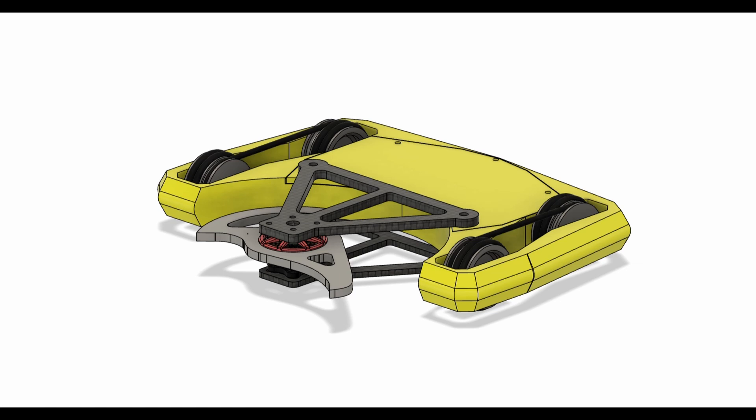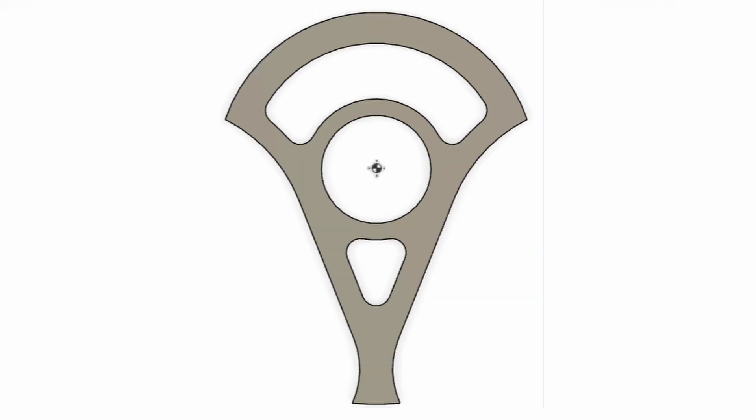Other than the new chassis and wheels, if I was to upgrade the blade from titanium to a steel like Hardox 600 the design would also change. Hardox 600 is basically indestructible at this weight class so we could do away with a double-sided tooth in exchange for this very scary shape. After printing everything I could, it was again off to get the blade cut from Hardox 600 by James.